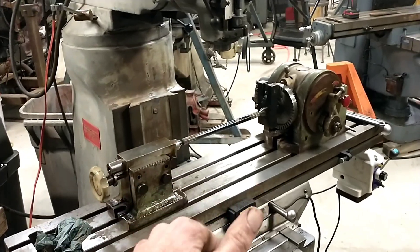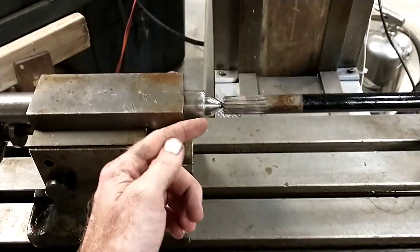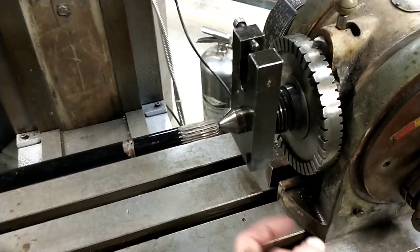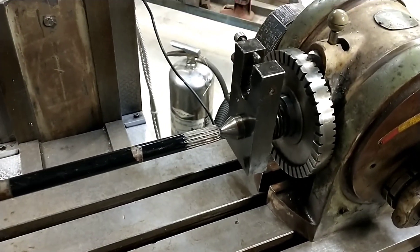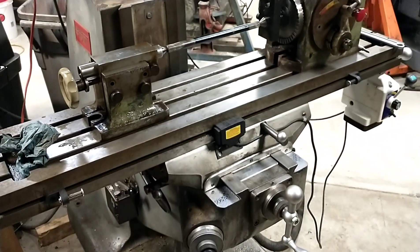As a result of that, I try my best to never let big heavy stuff hang out off the end if I don't have to. So I'm going to rotate the turret to the left with the idea of coming in and cutting from this end. I'll be plow milling against the indexing head because you don't ever want to risk having your Morse taper or center come loose and lose your indexing. I want to keep the load all against that when I'm machining.